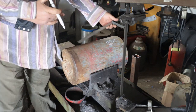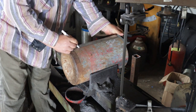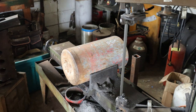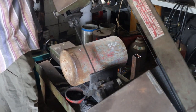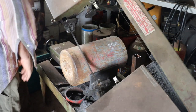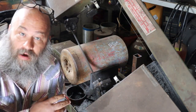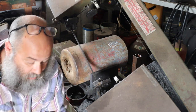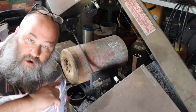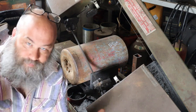It's just going to be a couple of videos, and this is the first one. We're going to try to get the material cut out, flattened, and shaped in this one. So let's get on it. First order of business is to cut a 12-inch section — that's 30.5 centimeters — off our tank. If you don't have a large bandsaw available, you can cut this with an angle grinder, a port-a-band, or something like that, just cutting it in sections. Mark your cylinder all the way around and cut the lines — pretty simple.